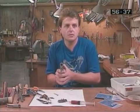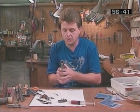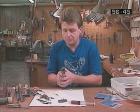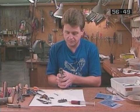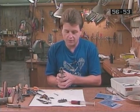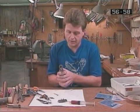At that point, if you haven't unscrewed it too much, you can play with it back and forth to make sure everything's set right. Now, if you unscrew it too much, what's it feel like? You'll have excessive over travel in the trigger. This way you've got the least amount of over travel possible with everything cut like it is.